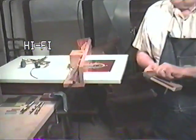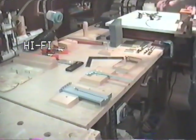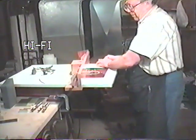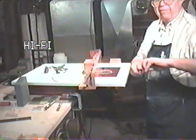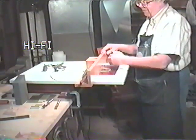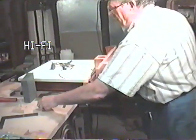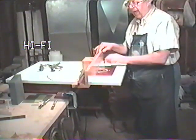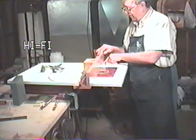Other locating means can be used, as shown in some examples here. Now, all the measurements we've been talking about have been from the center of the router bit. Let's say we had a half-inch bit in place in the router. If I then take a half-inch drill bit and place it between the fence and the locating post, that means the face of my fence just matches the rear of my bit. In that case, if I put another spacer in between the bit and the fence, I've accurately set the face of the fence relative to the rear of the bit to half the distance of this spacer.